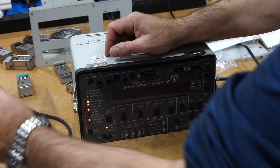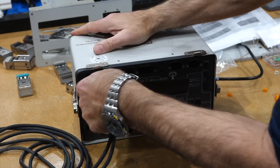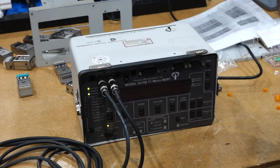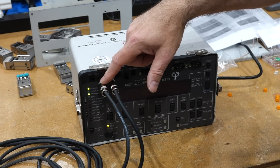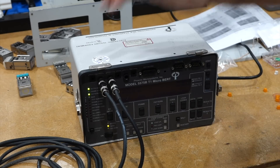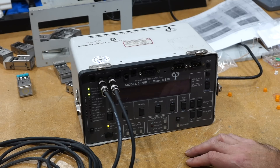Of course there is no T1 line, but if I just put this — it's missing a few screws — that will be my very, very, very short T1 line, and it gets it! For the Telco curious, which is my field: a T1 line dates back to the copper-based telephone era. It's a fancy name for a regular twisted copper phone line pair, used to transport 24 digitized phone lines at 64 kilobits per second each, for a whopping total of 1.5 megabits per second on plain copper wire, with runs of 2 kilometers between repeaters. That was the first big upgrade to digital coding of the basic phone carrier plant, which gave it a x24 bump in capacity.